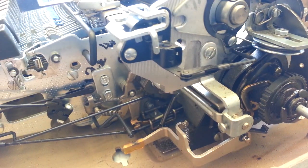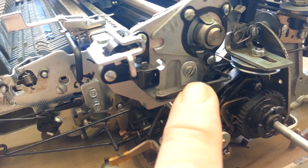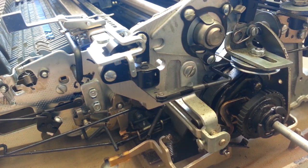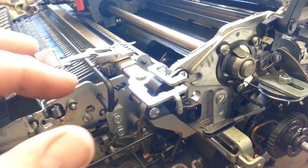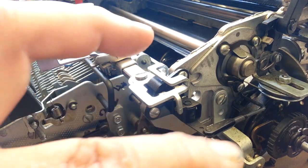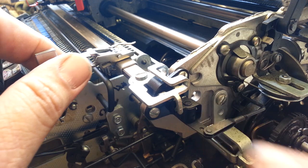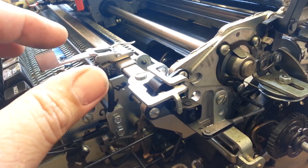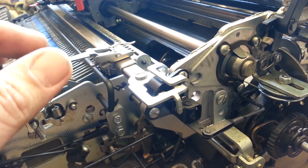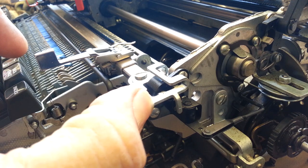I have seen this before and kind of forget about it. So I'm looking at this — there's a link moving free, sure — but what's not moving free is the rack itself. Here's the margin rack, and that's what kicks it out when it gets to the end; it kicks it out with this little edge right here. This moves and kicks it out. That should have sprung back to position right there. If you look real close, it's not springing back.